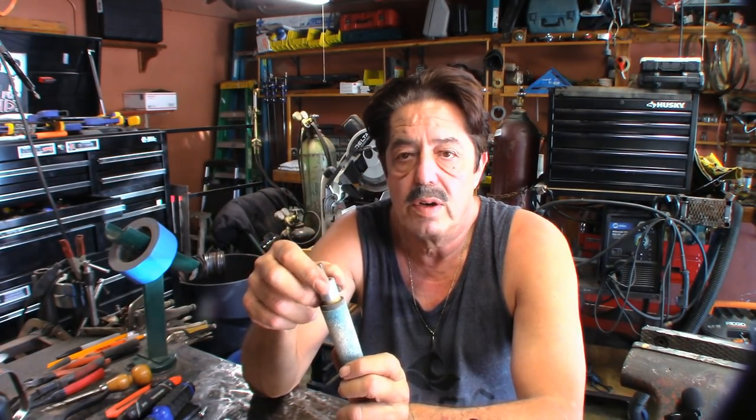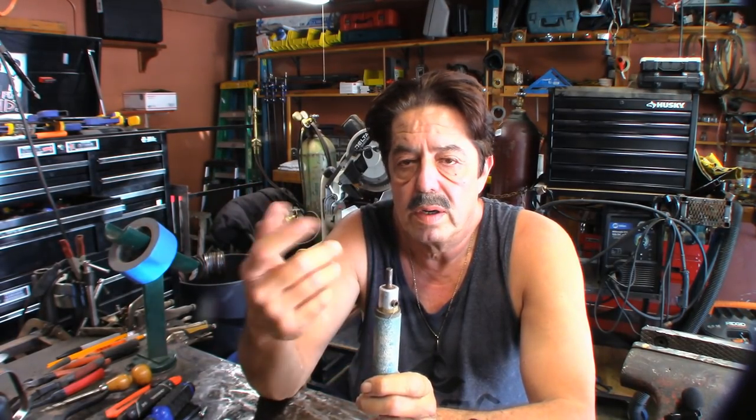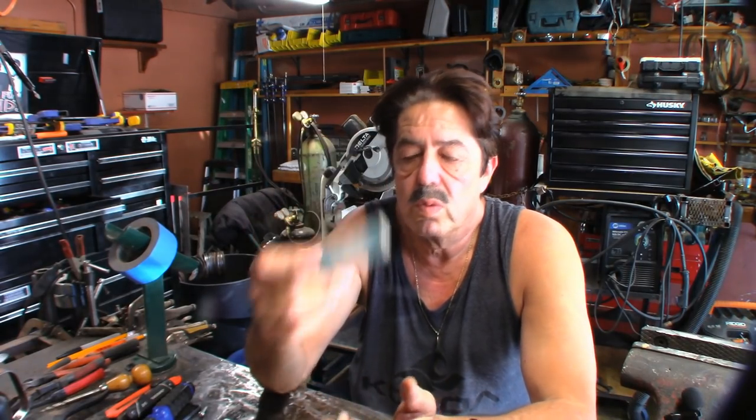I have a hole through a piece of thick wood that this mandrel goes down through, then I lock the drill press and bring the wood up to do that inside corner. For precision work, get a thick piece like a two-by-six or two-by-eight, drill a hole with a hole saw all the way through it, put the mandrel on your drill press, bring it down through that hole just a little ways and stop. Sand, clean it off with a brush, play around — these work well. I use 80 or 120 grit, mostly 120 because I don't want to keep sanding through many grits. For those corners I'll go up to 150 max before applying a film finish. They come in kits with different sizes — work great with drills or a drill press.